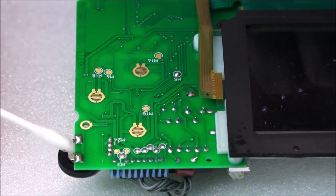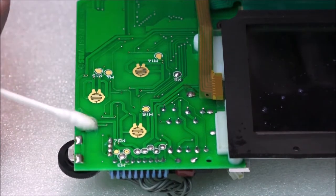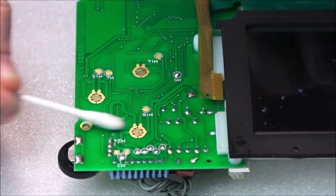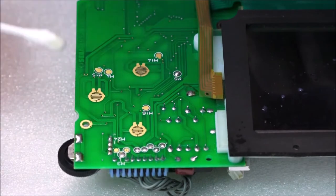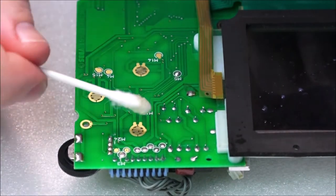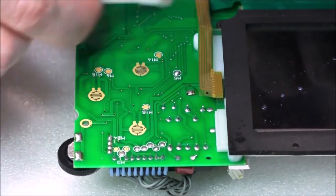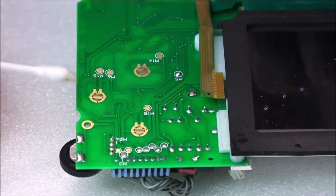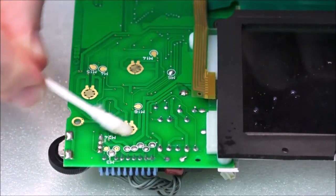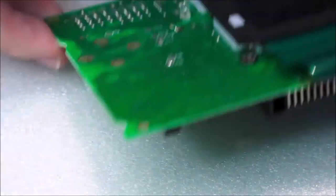Just in case also, because basically it's quite thick solder, so it could have cracked underneath and caused like a minor short or become like a resistor, because if the right amount of metal isn't there, it can actually cause resistance, and then it won't get enough power from the switch to the backlight, and that would cause both heating and failure. Because all the other components aren't getting the right voltage as well. Aha, you say. So a lot of this stuff I'm talking about isn't typically addressed in my experience.